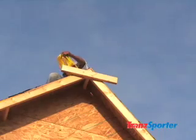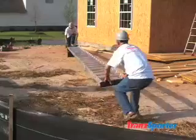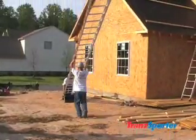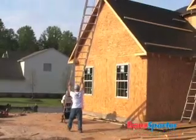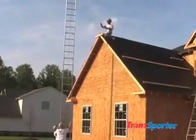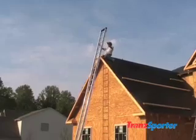Lay the platform hoist parallel to the building wall. Tie a rope to the top cap. Have one contractor pull the rope from the roof while the other braces the base unit shoes from slipping. The third contractor walks the hoist up hand over hand by the track rungs. When the hoist reaches a vertical position, carefully turn 90 degrees.